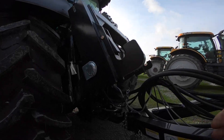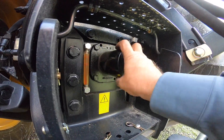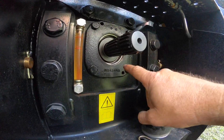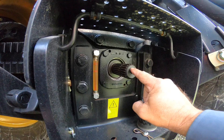We're going to look at this Versatile 335. The Versatile 335 and 365 front wheel assist tractors do not have the dual speed option — they are 1000 only. However, you can change the shaft size. It comes with the big thousand shaft, but you can change it and put the small thousand in, going from inch-and-three-quarters to inch-and-three-eighths or vice versa.